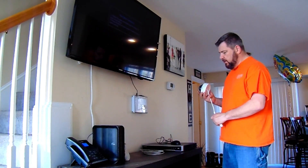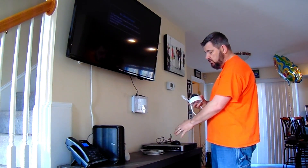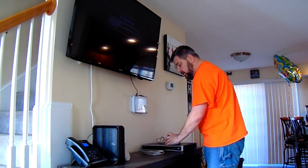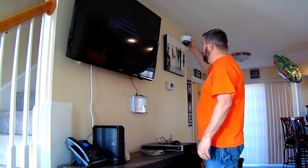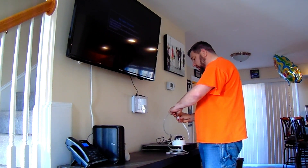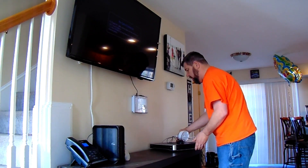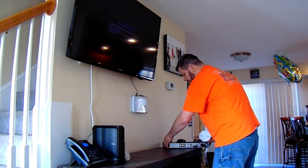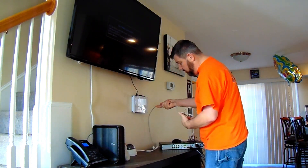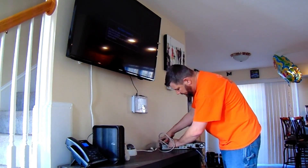We have unboxed the product. If you look at the top of your screen you will see a link to the unboxing of this NVR — we cover it in detail so if you need to reference that you can. As stated, you just mount this camera wherever you want it, run a CAT6 cable from the camera location to the back of the NVR. We want to wire this camera — since it's camera 1 — into the number 1 port on the PoE switch.